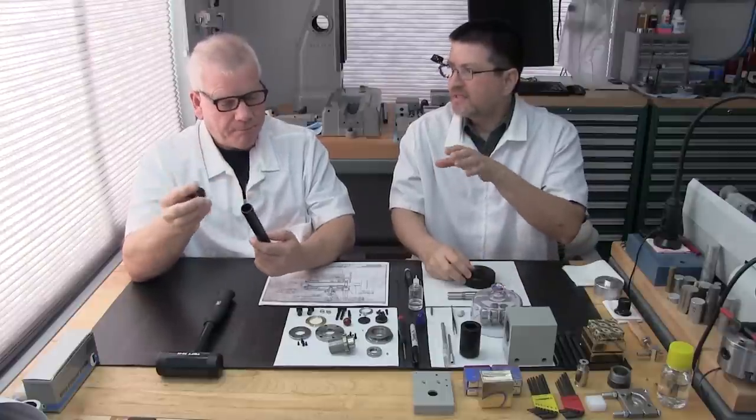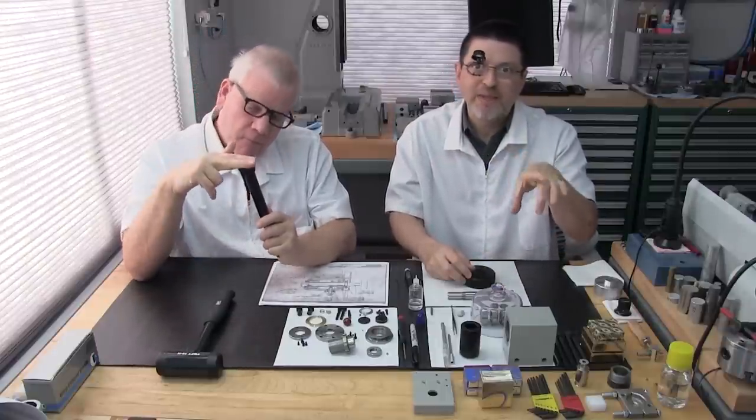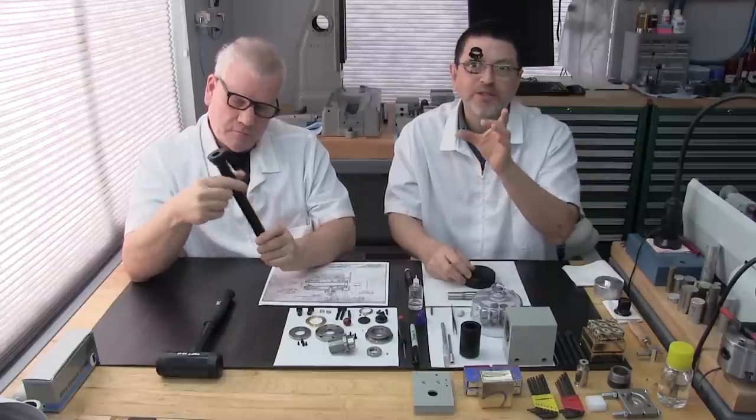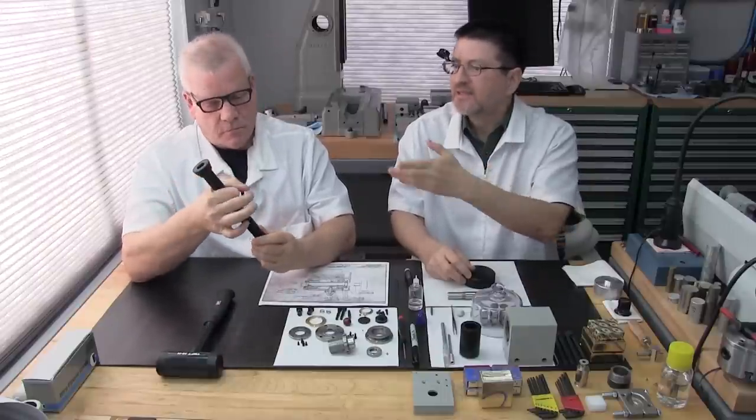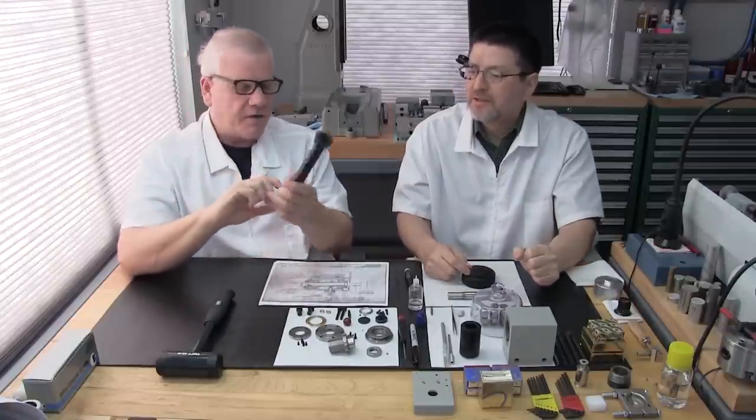One tool does all. In this particular case, it's not generally how it works, because some headstocks, like the 3C headstock, had a deep groove bearing that was a different size than the angular contact bearing, so it required two different bearing dies. And this is my post. That's right, okay. So there's that.